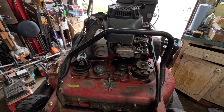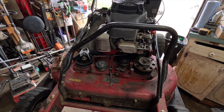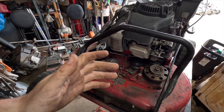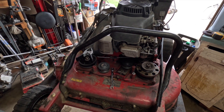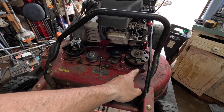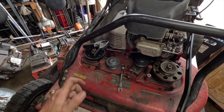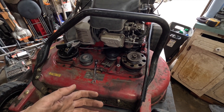The owner said shortly after the repair it had started to develop an incredible taste for belts. I'm going to turn off the fuel right now because nothing good is happening. In addition to devouring belts, there's a lot of rattle every time he puts a new belt on. Over the course of looking at what's going on, I originally thought it was the bearings, but luckily it's not. However, these have a lot of play - the little pulleys on top of the spindle - and that's not good and it's going to rattle.